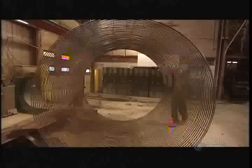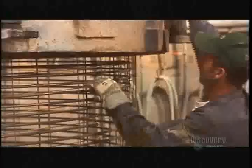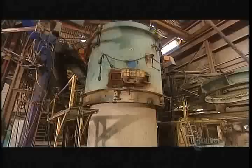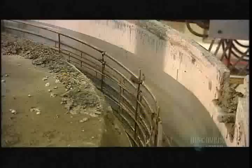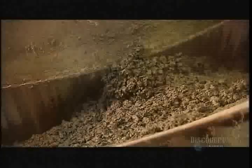The process for making large diameter pipes is slightly different. A welder fuses spacers to the cage, both inside and out, to center it inside the mold. Workers position the cage onto a base ring, then lower the outer part of the mold — called the outside form — over it. After securing it to the ring, they lower the unit over the smaller inner part, called the inside form. An overhead funnel pours concrete into the cavity between the two mold forms. Powerful electrical vibrators shake the mold, forcing the thick concrete downward and filling the cavity. This process is called vibration forming.